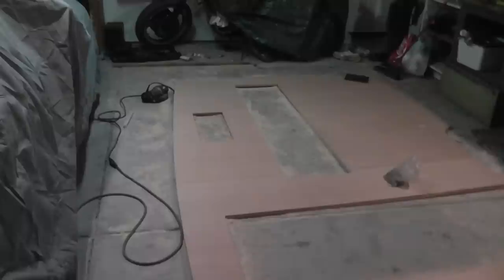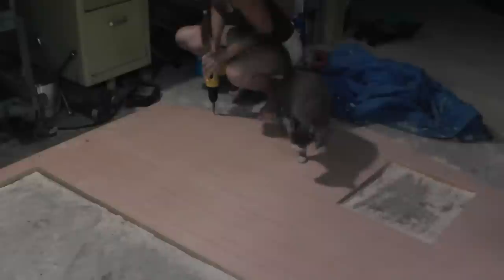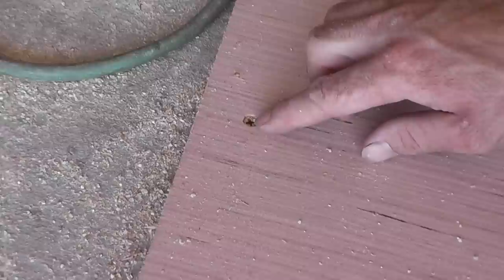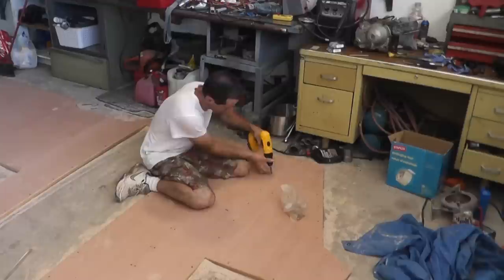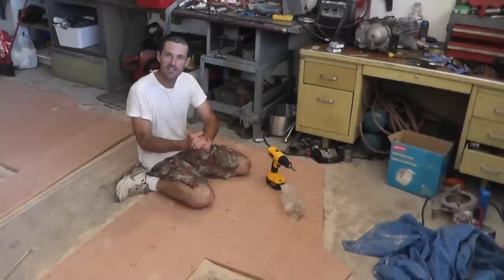A lovely summer night spending time with people I love, crickets chirping in the moonlight, cool breeze — a lovely evening for fastening. As I'm screwing, I'm taking care to sink the heads of these screws below the surface of the plywood so I'll be able to fill the void and the finished surface will be smooth. That is the last screw. And aside from sanding and painting, the construction of this wall is complete. Next we just need to successfully transplant this donor wall to the needy and deserving recipient — I need to gather my thoughts and courage before attempting that procedure, which will be featured in the next episode. Thanks for watching!